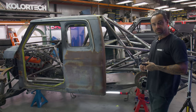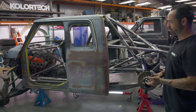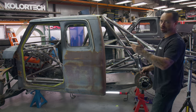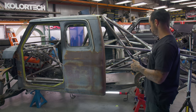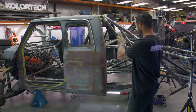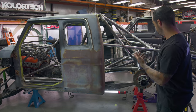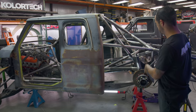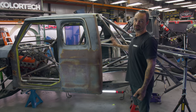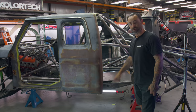One of the, I guess you could say, elephants in the room was the trailing arms that we had to do. Even though we got the truck working good, we needed to get the up travel. Eric, if you go back on the channel a ways, to where the truck was, the Tundra was orange and black. Eric brought it in, he put different shocks on the rear, but he wanted to get more up travel out of the thing, notch the frame, redo where the bump stops go, and put new trailing arms on so we didn't have to cut the shock mounts out of the chassis because we didn't want to do all that. And the path of least resistance was to build a different trailing arm.